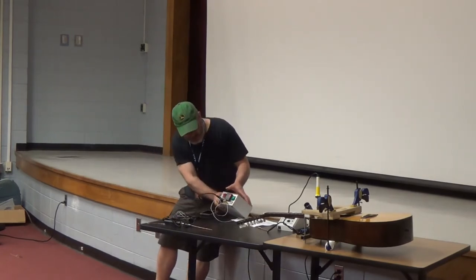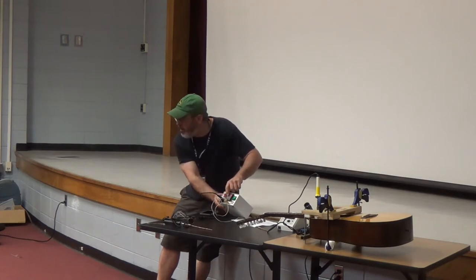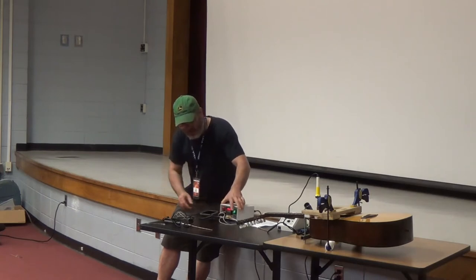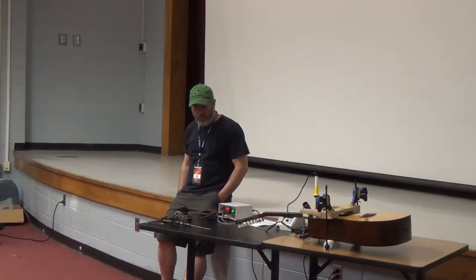I don't know if you know this, but if you hold the set button, eventually you get this funny little symbol right here. This becomes percentage of voltage. So when you dial this up and down, that's like 1% of 100% voltage. So you are actually independent of the thermocouple at that point. You don't have to use the thermocouple. So that's something to think about. And that's how I use that on blankets and everything.